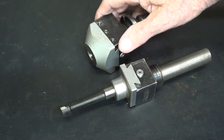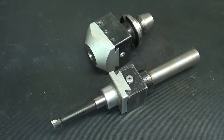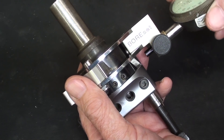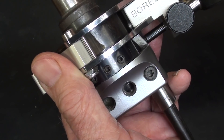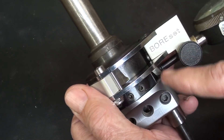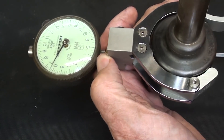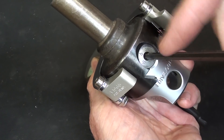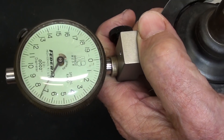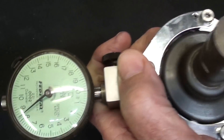Lots of boring heads are square in shape, such as these two Criterions, and of course the Bore Set could not be used with those boring heads. The indicator would be mounted in the Bore Set as such — watch the probe tip, bring that right up against it and tighten. You want to make sure that you still have some travel. Turning it around like this, I have my Allen wrench in the little graduated dial and I can move it in and out. The beauty of this is I don't have to worry about backlash, because I'm getting my reading here on the indicator, not on the little dial that would be subject to error by backlash.